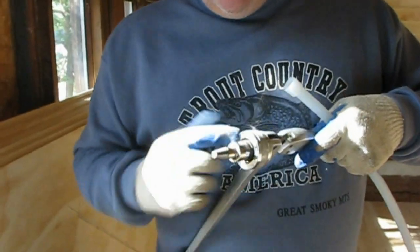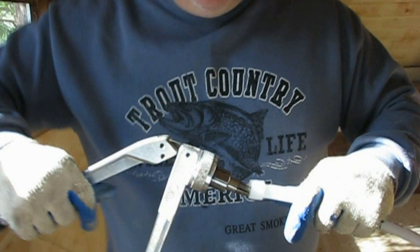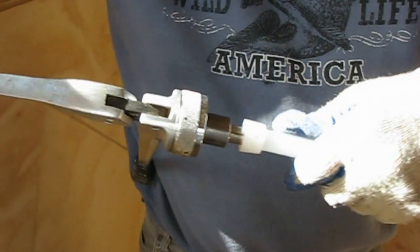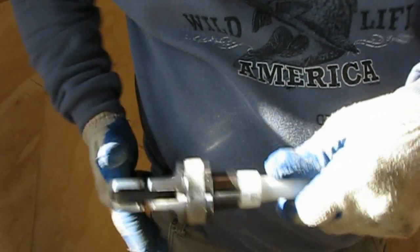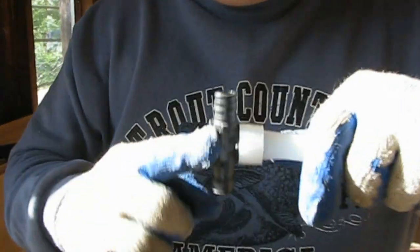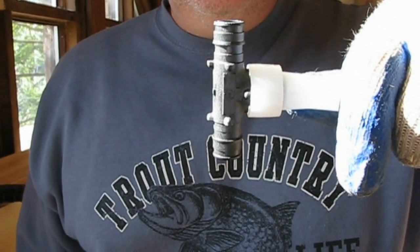Now, always make sure your head is secured fully on. Otherwise, you won't get the proper expansion. You want to insert it into the tube, crank, turn, crank, turn, crank, turn, crank, turn, pause for about 3 seconds. Remove. One Mississippi, two Mississippi, three Mississippi. Insert your fitting. So that secures the fitting on both sides, the pipe and the fitting?